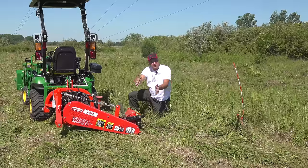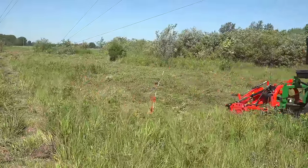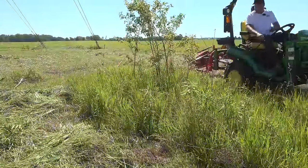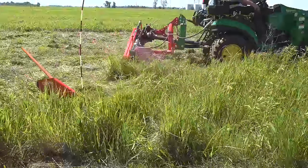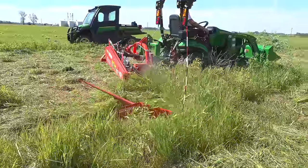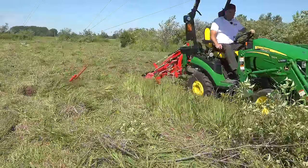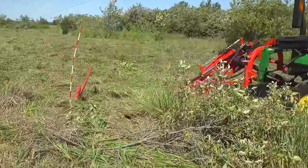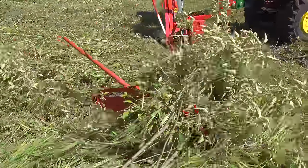The rough conditions here do illustrate one of the positive things about this sickle bar versus another type of mower that can mow offset of the tractor. We showed that flail from the same company on a 1025R in a previous episode, and we showed how it was just all the 1025R wanted out to the side — it put some strain because of the light weight and wanted to tip the tractor up. We had no tipsiness at all here. This mower is much lighter weight — that's almost a six-foot cutting width and it's probably eight feet out from the tractor, and it doesn't seem to cause any trouble at all.